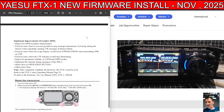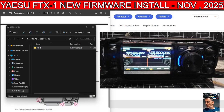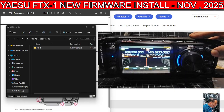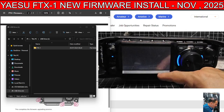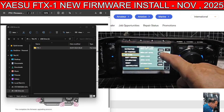Other minor fixes — and you have to do a factory reset at the end of this, so make a backup first. I've backed up on the radio. If you've not used your SD card before, press and hold the function button, go forward or back until you see extension settings, tap it, then go to SD card and you can save here.